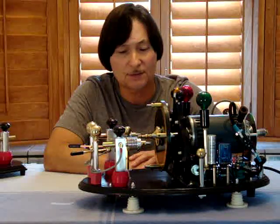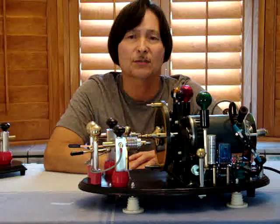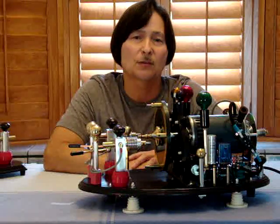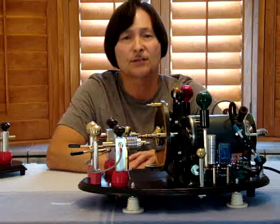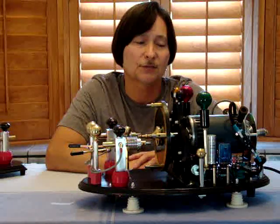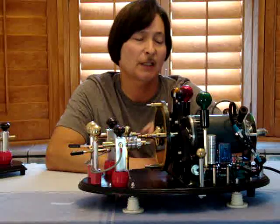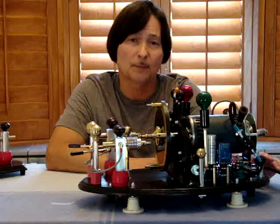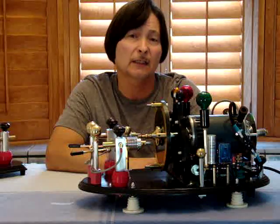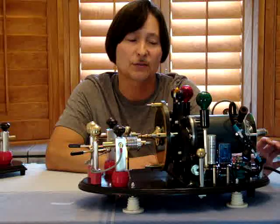As far as the circuitry, this type of motor requires a capacitor start circuit. When you first fire it up, the capacitor is in the circuit and then has to be taken out. I have a logic circuit I built, and when you first apply power a red neon light comes on to let you know there's power applied before you turn on anything.